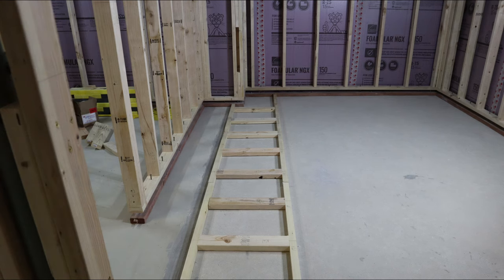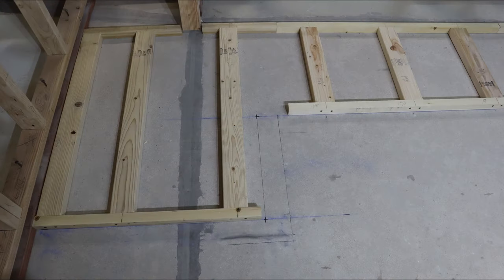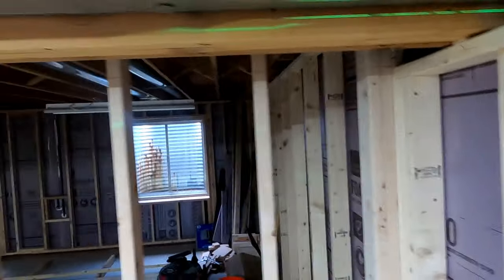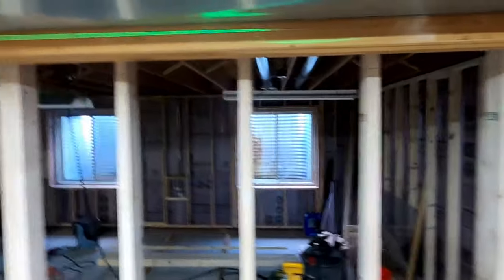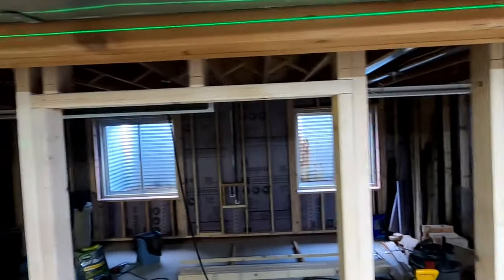The long vertical sections simply follow the outside of the horizontal sections, but I needed to account for the short offset section where I drew in both sides in pencil. Now that I have my horizontal ladder sections assembled, it's time to lay out the vertical ladder sections. I set my laser up to clear the ductwork, but also to leave enough of the support beam exposed to attach the horizontal ladder sections.